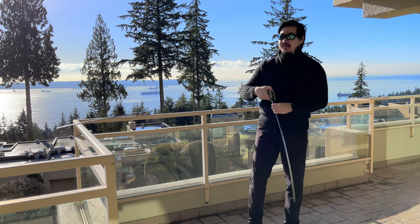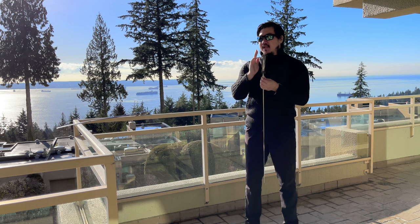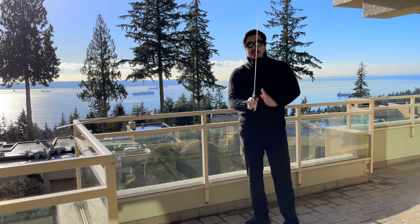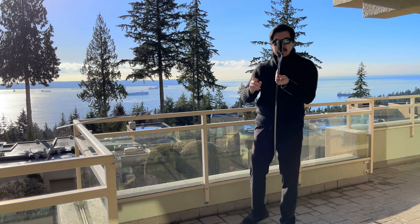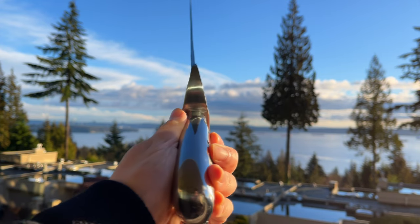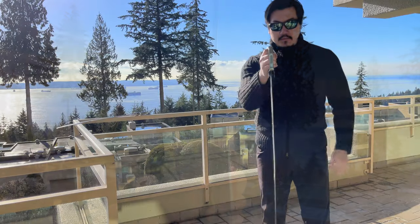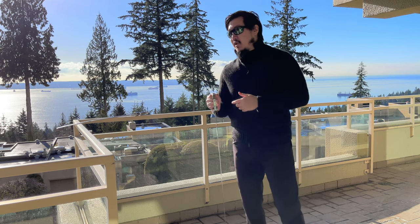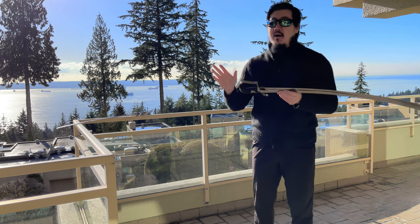Assuming that the entire hilt is bent, it might mean that the tang within is also bent. So this creates a hot spot. When you cut with a sword, it could have some stress where it starts bending and then it goes shatter or stays bent forever. But when I look at this, I see every piece of fitting on the hilt has been crooked or misaligned in some way. This P-shaped stirrup guard is asymmetrical. And we have observed this on the Wakefield hanger, also made by Windlass in the Royal Armouries collection. That's a lesser issue. I'm not looking to have perfect symmetry, especially on a budget reproduction.